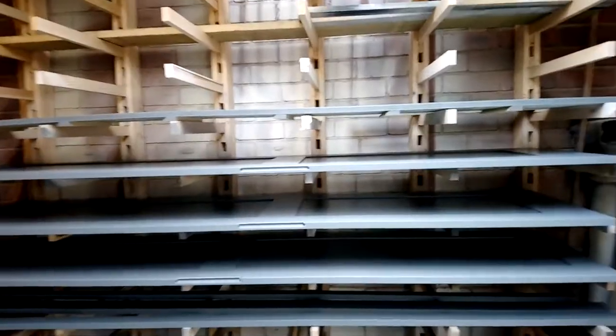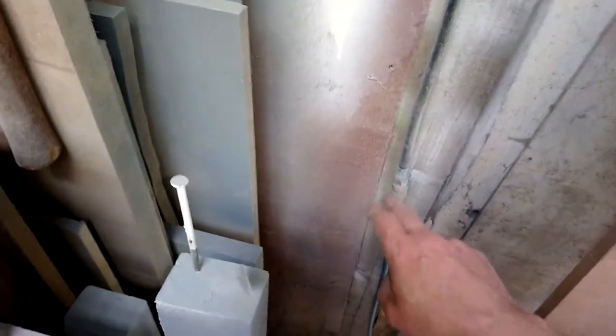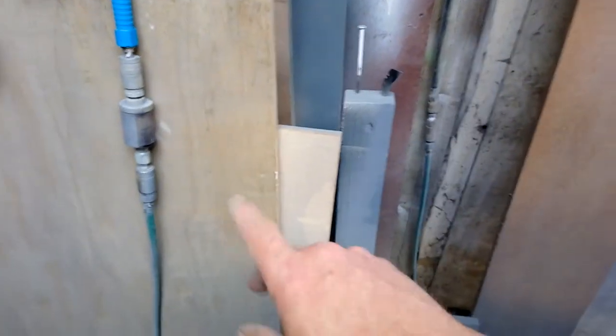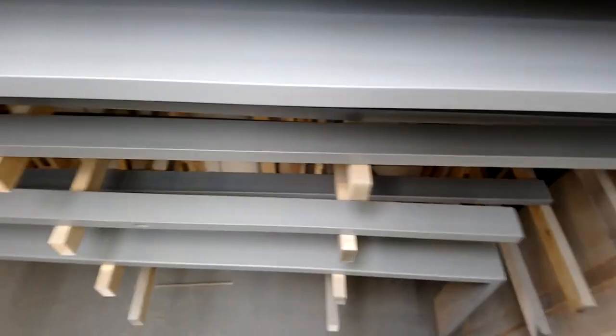Right, that's it - all the painting's done. Handles turned out alright, we'll see what they look like when they're on. But not a single fish eye this time. This pipe - I used to have the filter back here but it didn't always have a filter on it, so oil from the compressor's been coming through and that must have been it. Since moving it up here, that's solved the problem - that was the fault, I presume. Like I say, no more fish eyes.